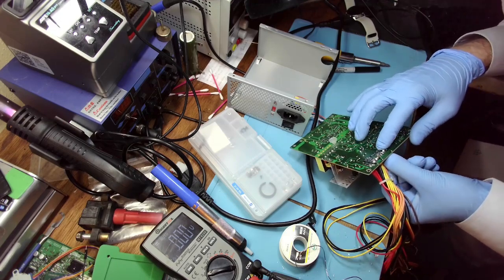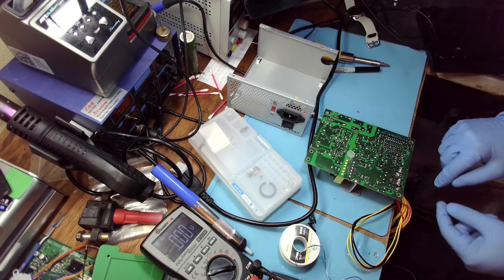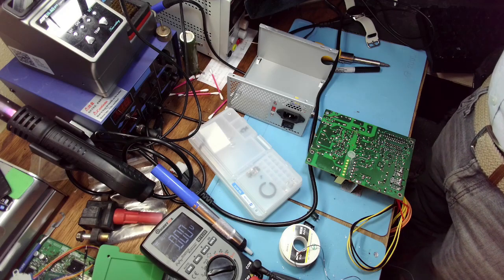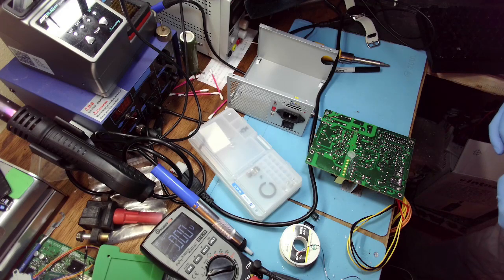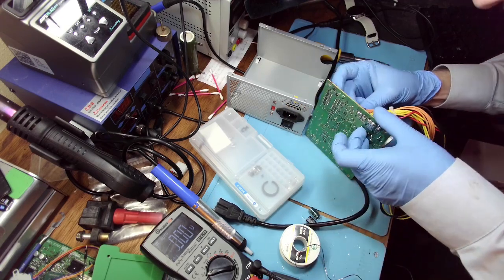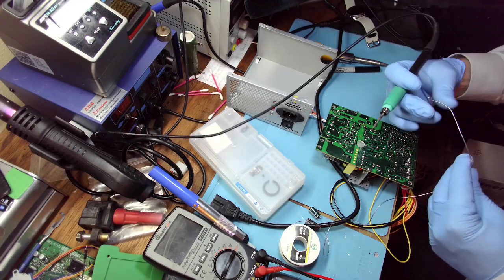and it connects, 3.3 should connect it to ground. Yeah, there's a jumper here. There's a jumper, and it connects it to the ground. So that's weird. What did I say? 1000. Let's do 1800, and that's gonna be 6.3, because I do believe that this has been improperly replaced. I mean, not improperly, it's not gonna break anything if you put 16 volts instead of 10 volts. The other way around, it will, but this way it's not too bad.